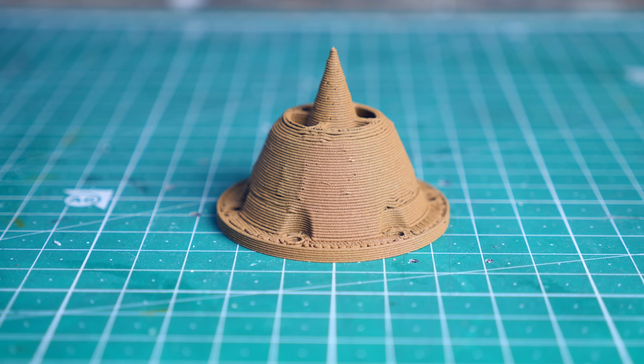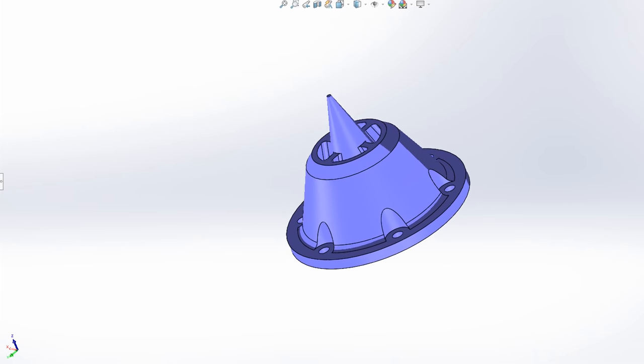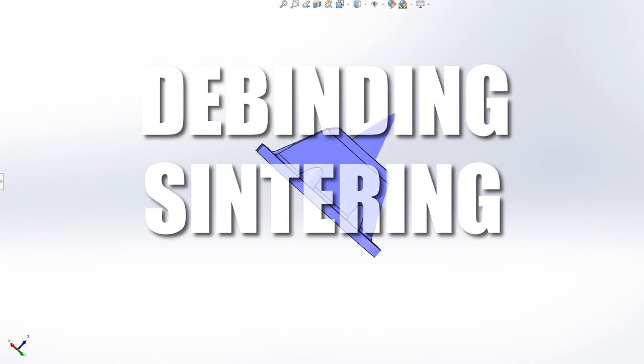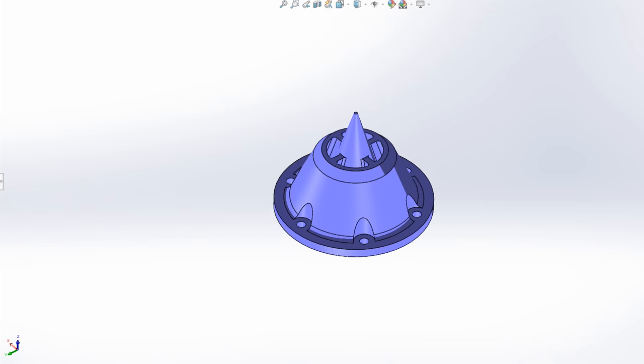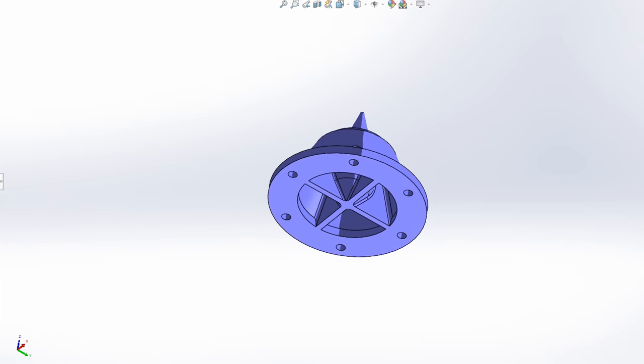The part came out looking pretty nice but still had plastic in it, so the next step was getting rid of it. To get rid of the plastic we need to burn it off, but that is not as simple as putting cookies in the oven. The part needs to go through two stages: debinding and sintering. During the debinding stage the plastic burns off slowly — actually it sublimates. Once the plastic is all gone we ramp up the temperature to unify the metal that was left behind. To do these stages the part needs to go through a thermal cycle that can reach hundreds of degrees and to do that you're gonna need a programmable kiln.